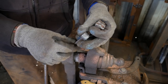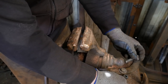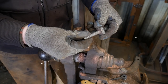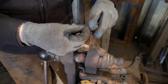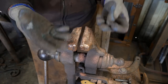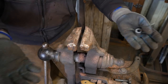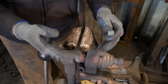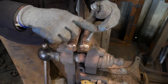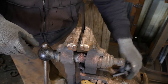We're going to start with the clevis portion first, then move to the door bolt. What we need to do with the door bolt is clean up the shank and turn it completely round with a file in order to thread it, and then drill and tap the nut to suit. I'm not going to cover drilling and tapping — it's like any other drilled hole where you run a tap in. I'll show you how to file it up to run threads, then show you the finished product.